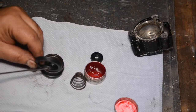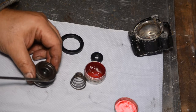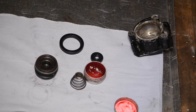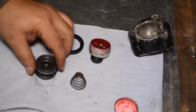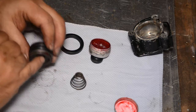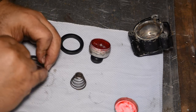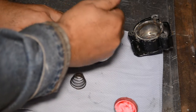So let's start putting this back together. This is the inner seal that fits on the piston. It goes on in a specific way — the seal itself is tapered and it's fairly obvious how it fits, but you could always take some images when taking it apart so you can recall how it all goes back together. Just putting on some lubricant because it's very important to lube up rubber any time you're going for an insertion.